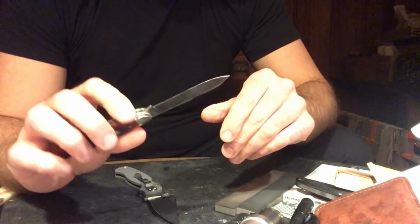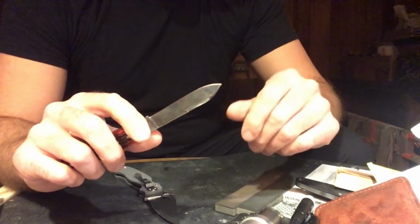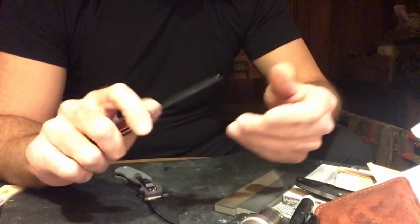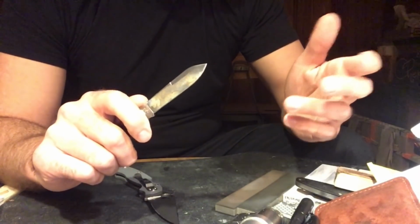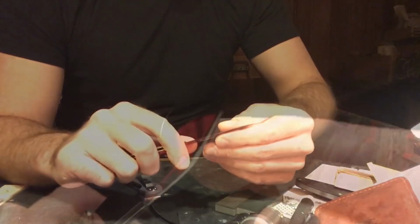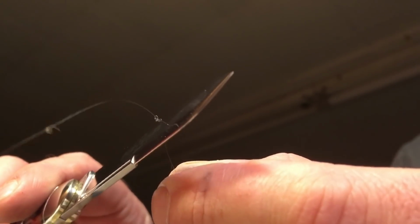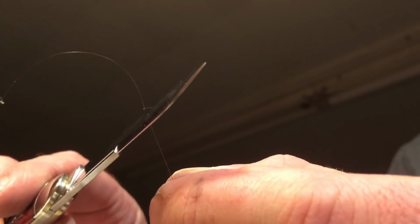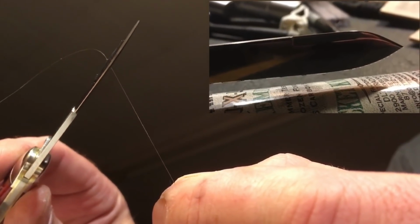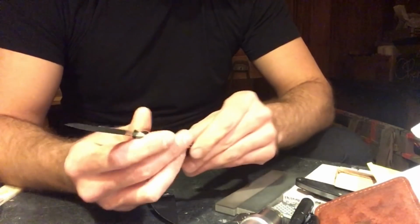This knife took 7 sharpenings that weekend to get the edge to hair whittling, to get it to be able to form a proper apex. I ended up moving from Waterstones to a coarse DMT plate just to help remove material. It was fine. I came through it okay. I posted about it on Edge Snobs, and there was some discussion there. I kept the bevel looking the way that I wanted it to look going into the first sharpening, and that didn't get compromised by the number of sharpenings all at once. But it was an interesting little piece of a weekend. Since then, I've been carrying the knife.